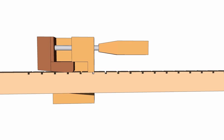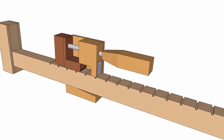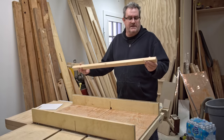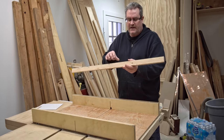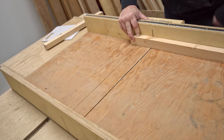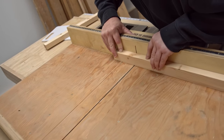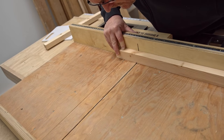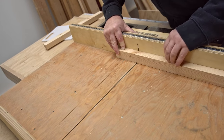The material I'm going to be using for this particular clamp is some old 2x4. I've already cut a piece that's an inch and a half tall and one inch thick — this is the bar of the clamp. What I need to do now is cut shallow slots in it, spaced one inch apart, and to do that I'm going to use my big table saw sled.